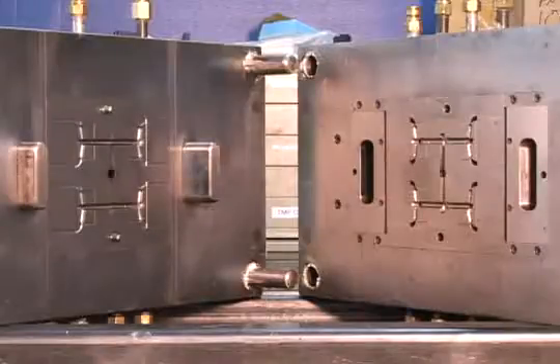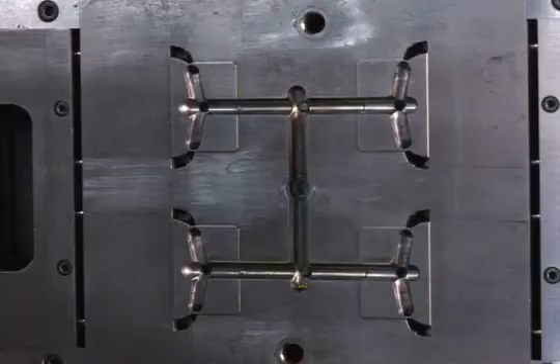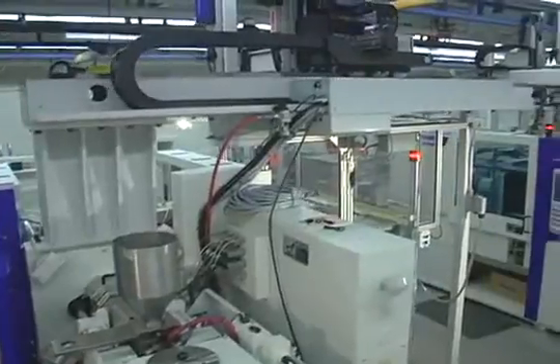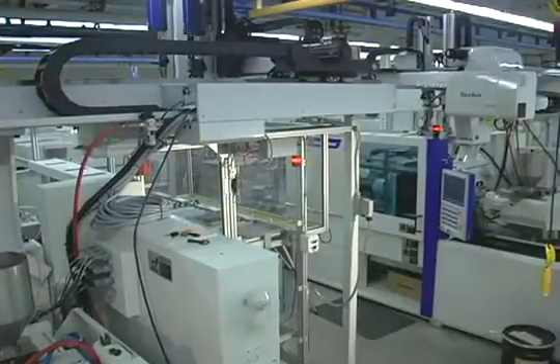One section consists of a core, which fits into an impression or cavity in the other section, with clearances that produce the desired geometric shapes. All features are designed to permit the cavity to release the solidified form, which is pushed off the core with the ejector or knockout pins shown here. After filling, the mold remains sealed briefly to allow the feedstock to be cooled, freezing the mixture into the desired shape, its highly complex geometry fully formed. Generally, the total cycle time for injection molding a MIM part ranges from less than 10 seconds to approximately 60 seconds, depending upon the part size, complexity, and the number of mold cavities that are being filled.